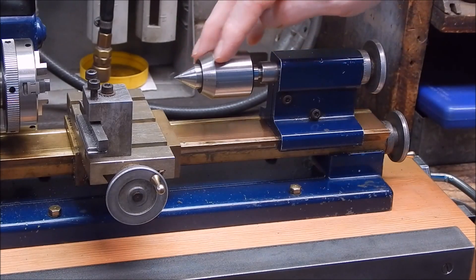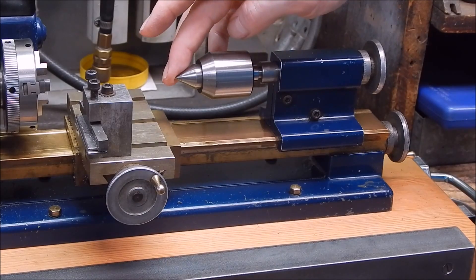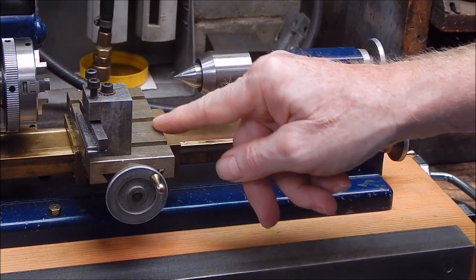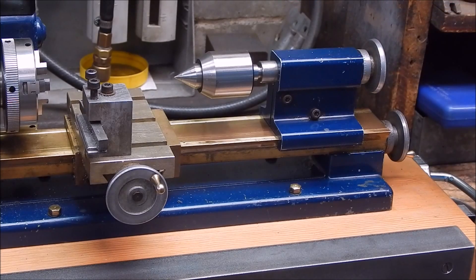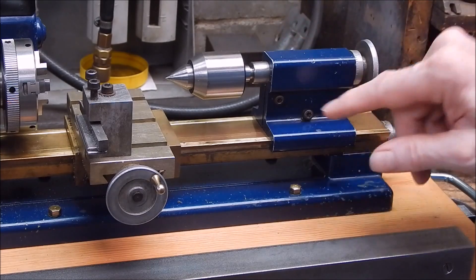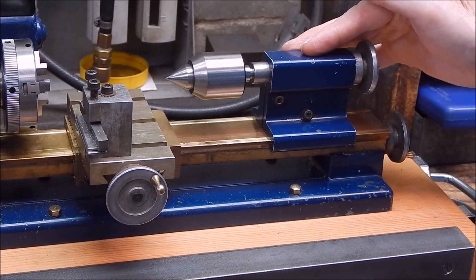Incidentally, this live centre that I've machined down from a Morse 1 to a Morse 0 is absolutely perfect — spot on, solved the travel problem completely as far as clearing the saddle and the cross slide. You look at this and think, how didn't I think of that originally? But of course that layout is confusing. So that's the trick to getting these things accurate. I hope it helps somebody — that's it from me, see you next time, cheers.